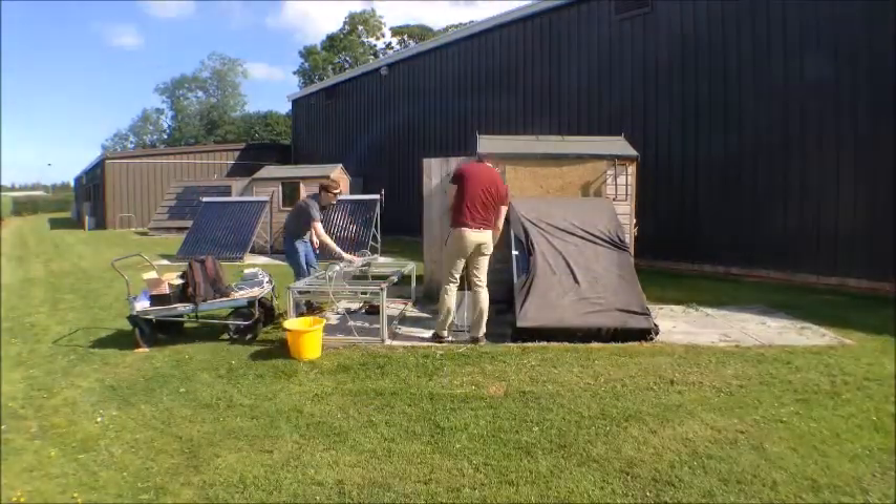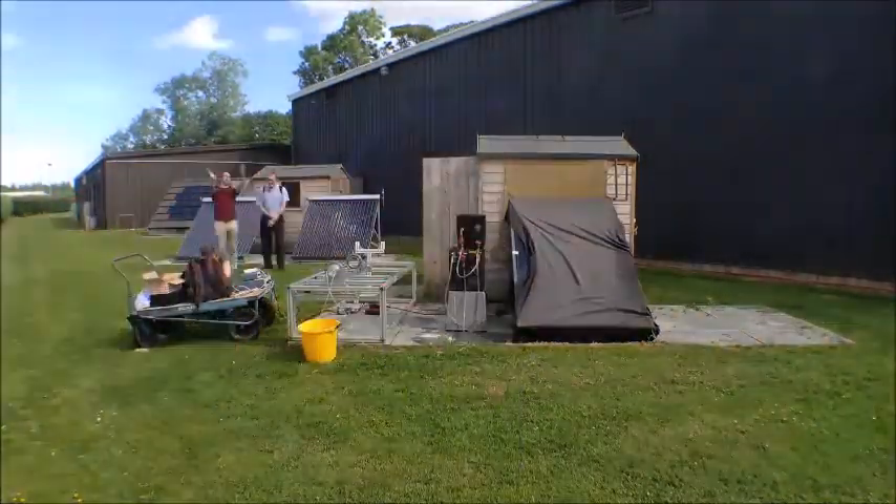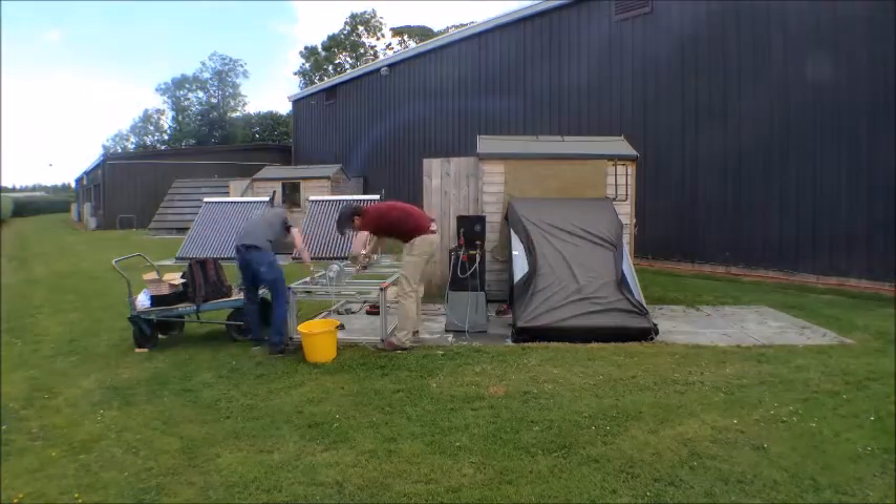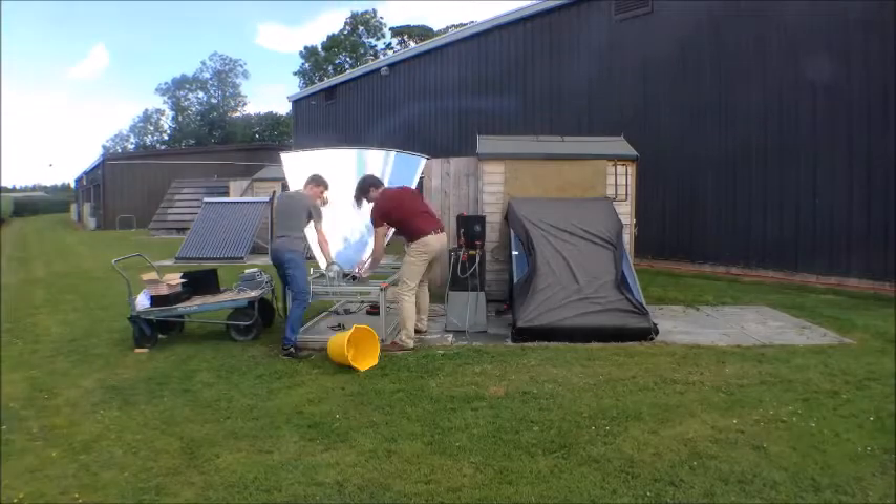Next up, let's look at the assembly of the entire structure. First of all, connect the motors and attach them to a power supply so we can exert the holding torque. Then we'll start mounting the dish at the rear first and then the front axles.